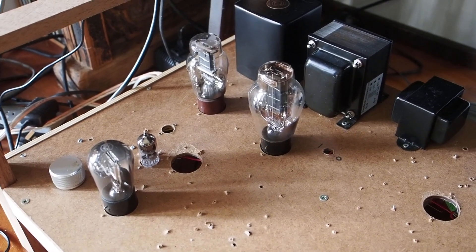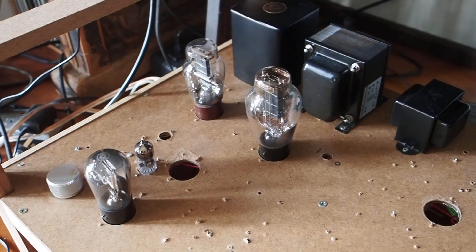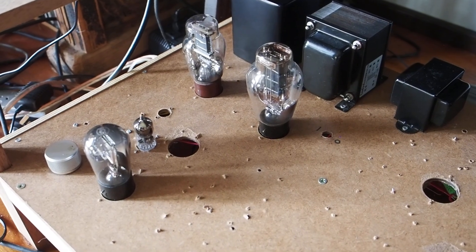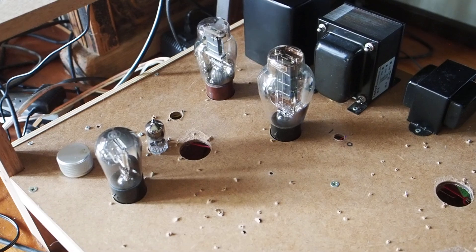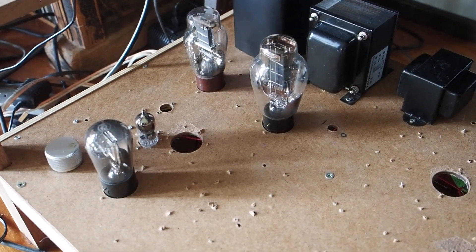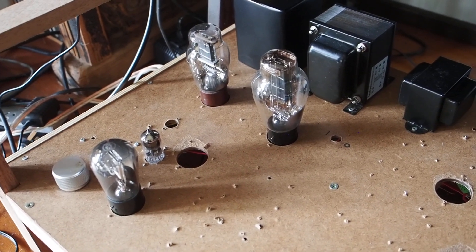The reason why you often don't notice so much is because loud sounds have a large masking effect, so it's natural for some details to drop away. However, what I noticed after this improvement were two things that were wrong with this amp. And by the way, thank you Janos, because you made a comment on the sound clip that I posted a couple of videos ago - that you heard during loud passages there was something wrong. I also had heard a strange modulation in the sound that just wasn't quite right. Because I know the experiment I did with the power supply, with these sharing a capacitor bank, that could well be the cause of what I was hearing. What I didn't expect is how much it improved the sound once I fixed it.